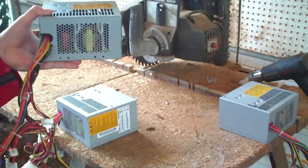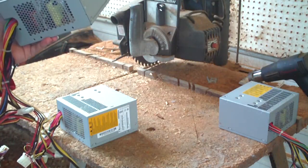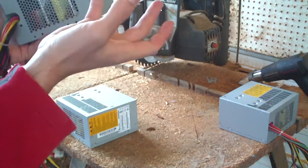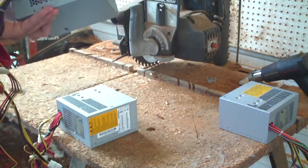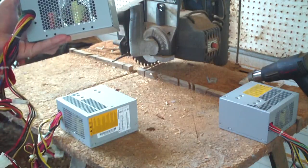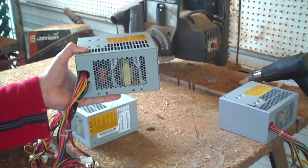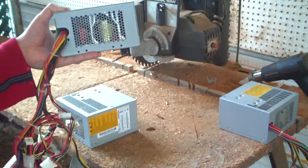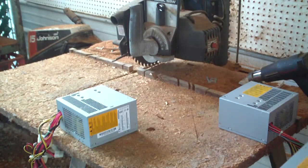Sometimes when you're working on power supplies or any electronic component and you're messing with solder, in some rare scenarios — even if you're careful — you may have a tiny little piece of solder become loose. If you've ever done solder work, you'll understand. A small chunk of solder can come loose and sit inside the power supply on one of the traces, and in some cases it'll short something out. So I'm going to use compressed air to blow inside the unit so that if there are any loose pieces of solder, they'll blow out just like dust.